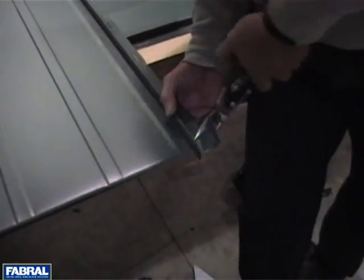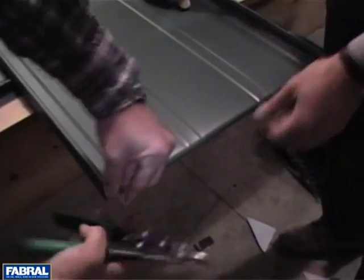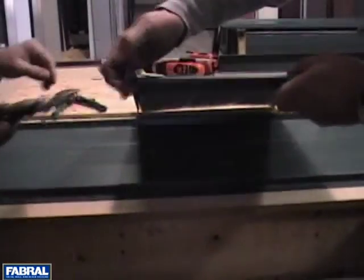Cut off the underlap rib completely. Remove inboard leg and rib top from overlap rib with tin snips. Bend tab around rib and cut flush.